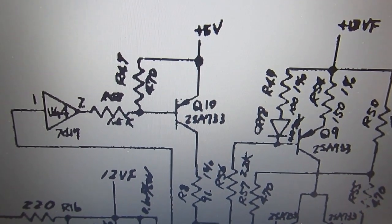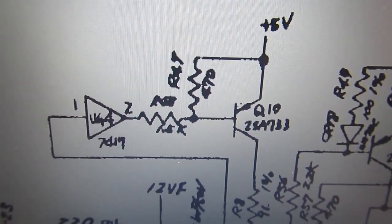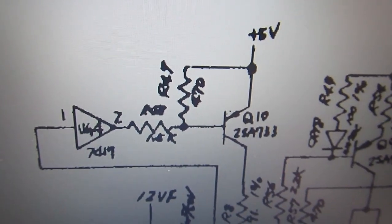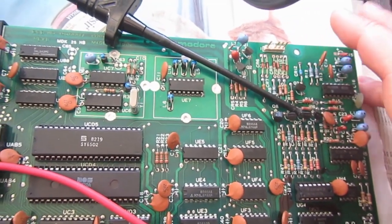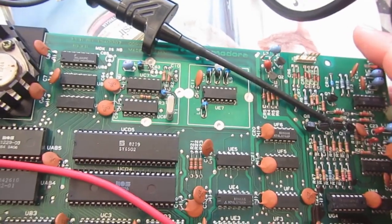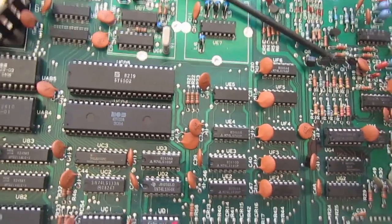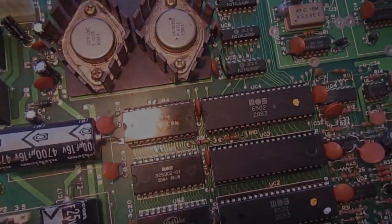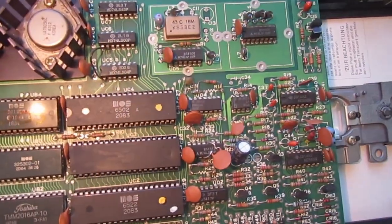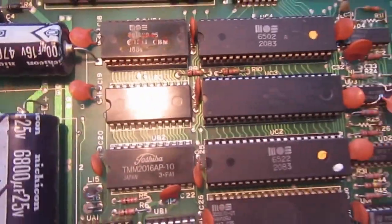Here is Q10 in the schematics. As you can see, there is that resistor in parallel between the emitter and the base. So now it's time to crack one of my 1541 drives open and install this board in place of the drive's board and see what happens. Okay, this is a 1983 1541 that I repaired some time ago,